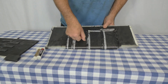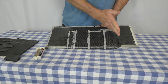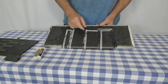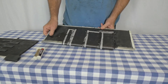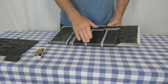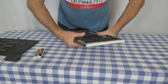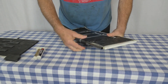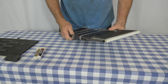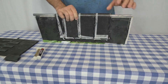I'm going to cut these into strips, cut off the extra on the end so that I can have multiple parts to run multiple tests. I'll probably be able to pull two parts here, two parts there, one part here — that'll be sufficient for testing and we'll get enough data to characterize the strength. This was a wet layup by hand, not vacuum bagged. I was worried that vacuum bagging would oval out the front end, which would be bad. I want to keep this a nice round radius, so by doing a wet layup with no vacuum bag the parts come out a little bit heavier, but we can tolerate that extra weight to get the appropriate shape up front.